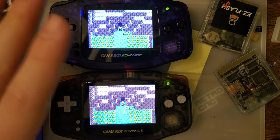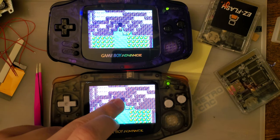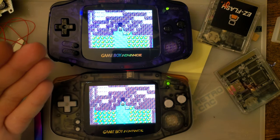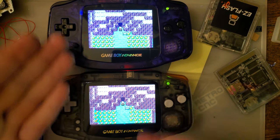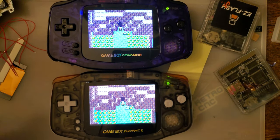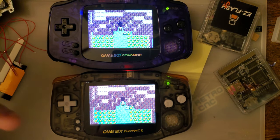Whereas with the pin 1 method, all of that will still work except for the wireless adapter. That still won't work because that requires pulling power from the Game Boy, and when you use pin 1, well, you disconnect power. But all the other linking stuff should still work if you use the pin 1 method. But, you know, it's a little bit more complicated of an install, and since you're cutting off power, you won't be able to use your Wormlight anymore. Not that I suppose it's that big of a deal, but yeah. Any accessories that require external power will not work with the pin 1 method. But most linking doesn't work at all with the pin 3 method, so it's...